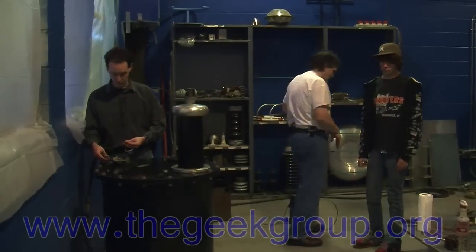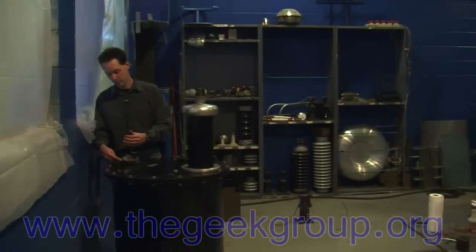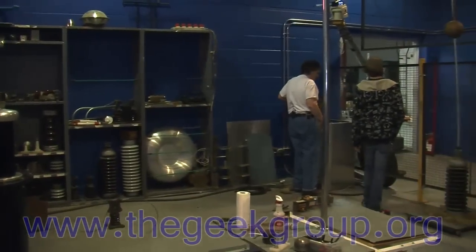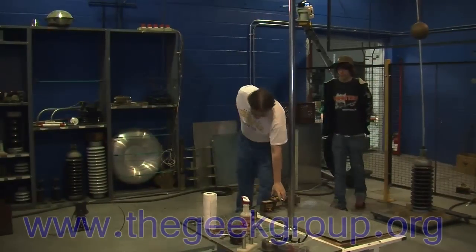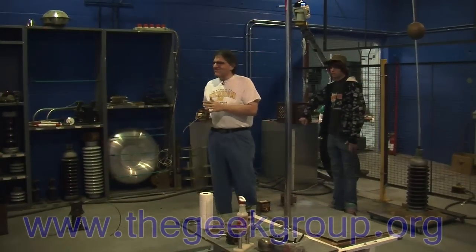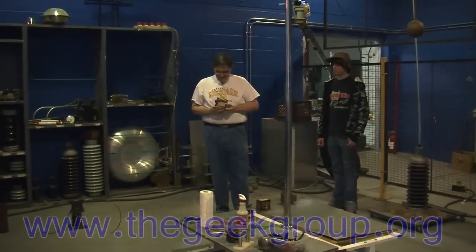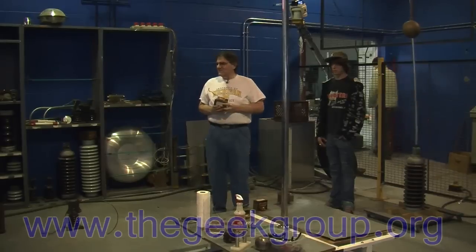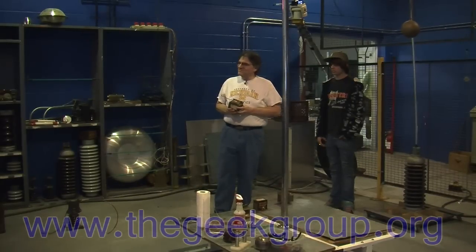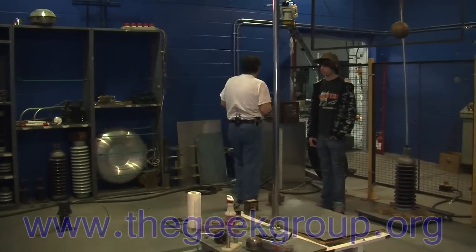All right, then take him and go find some 6-gauge. We aren't going to need that kind of... Well, find an appropriate gauge. We're running the MOTs. We're using the MOTs as ballasting. So the primary winding is all we need to current limit to. Okay. Better to run the secondaries open or shorted? Secondary shorted.